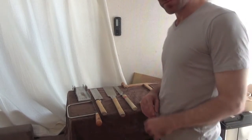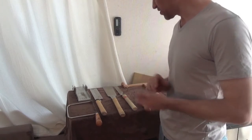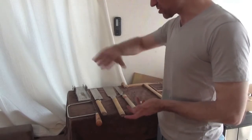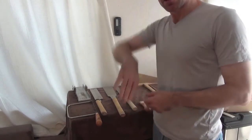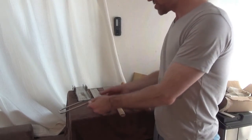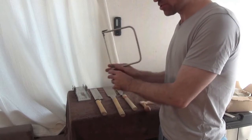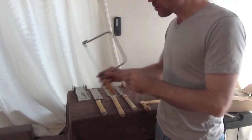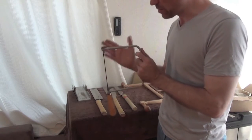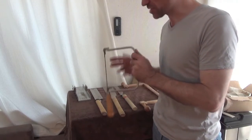Let's start out by going through some saws. There are three basic types of saw you're really going to need if you're building an electric guitar. The first type is something for cutting out complex shapes — bodies, around headstocks, that sort of thing. When I started out, I used a coping saw. A coping saw is great — you can cut curves and do all sorts of things. The problem is if you want to cut out a thick body blank, it takes a long time and puts a lot of blisters on your hands. I still use it for headstocks and detail work.